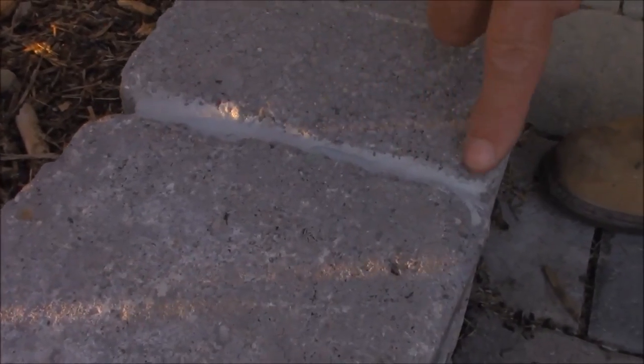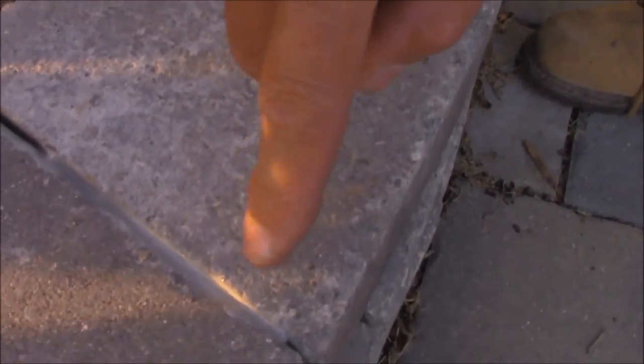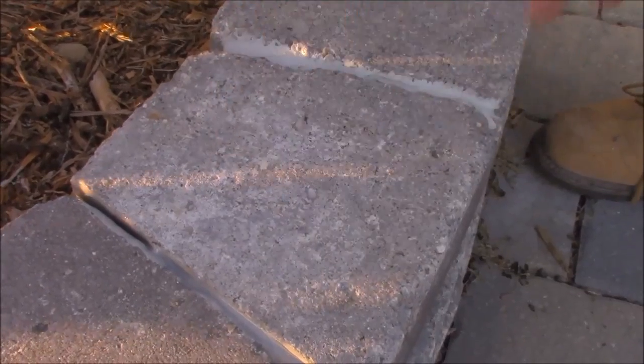We want to look more like a mortar joint. As you can see, this gun-grade caulk here is a little lighter than the self-leveling caulk. Now as you're doing different kinds of brick and cement, buy two or three kinds of caulk, do a couple of test samples, and see which caulk actually blends with the mortar of your house. Some mortars are grayer, some are a lot more beige — it's not always the first tube you choose that's the one. If you're going to spend a lot of time being very careful getting it in nice and beautiful, you might as well spend six more dollars and get exactly the right color. When you're done, you look like the hero. Your job will last a long time and you've done it right the first time.